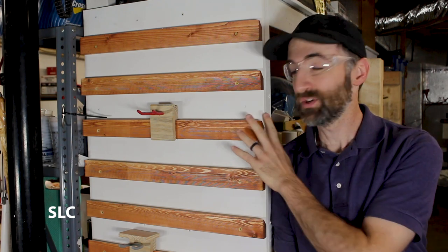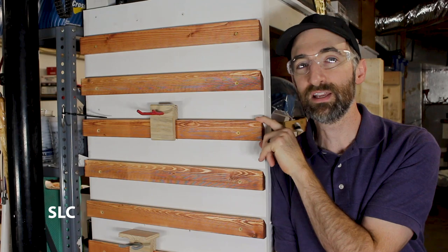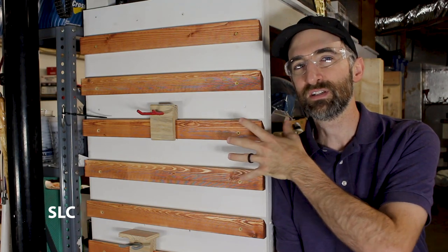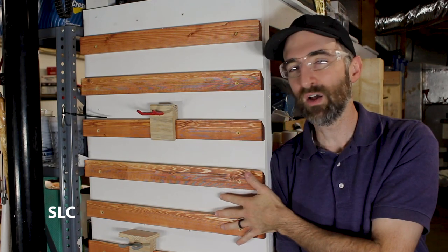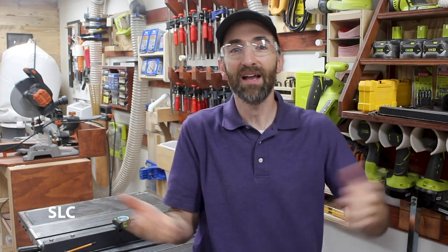Here's the end of the same pair of shelves. In this case I used some half-inch MDF and some smaller cleats. I'm using smaller cleats because I don't plan on putting as much weight on the end as on the facing, but in either case you can do what works for you. Now if you're new to French cleats, I have a series of videos where I've made over a hundred different French cleat items that you can see in my workshop, just to give you ideas for your tools and whatever you might have. I'll put a link to those in the description below, so make sure you check those out. Otherwise, get out in your shop and have fun building.